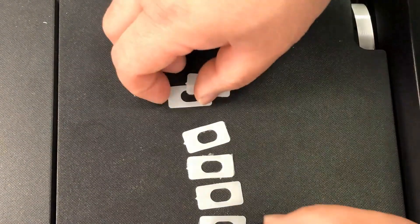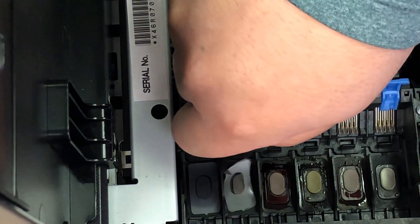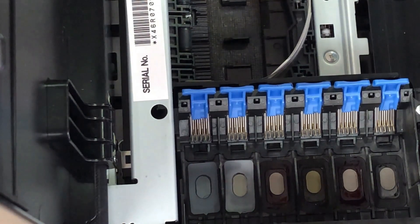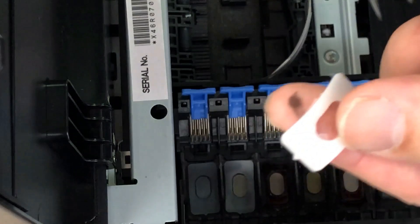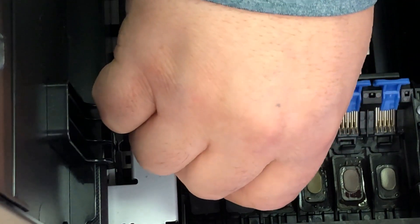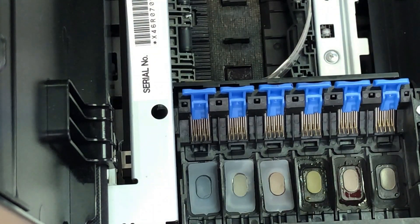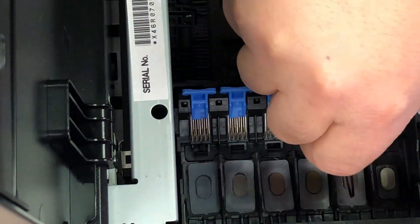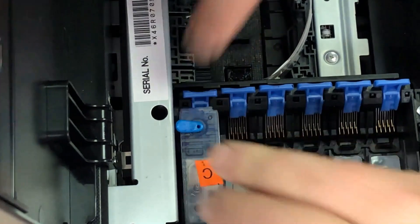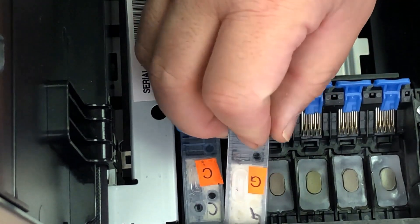Okay, now we've got six of them and they're ready to go in. It's better to have a tweezer. You might notice on one end it has a little triangle or arrow that helps you figure out the direction of the washer where it goes — just look for that little arrow. You don't have to install all of them; you can just install for the ones that have a leak. But when I install, I just put them all in so I don't need to worry about that anymore. Then you can put the cartridge back. When you put the cartridge back, you need to push a little bit harder, but it's not really hard — just push a little bit harder and you're going to hear the click. You'll have to hear the click.